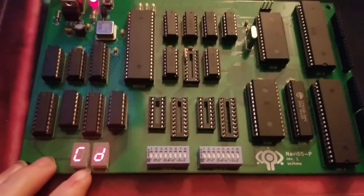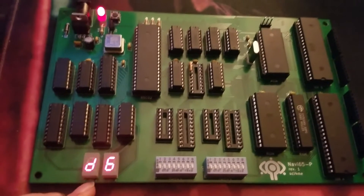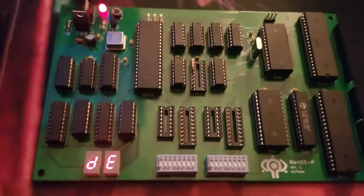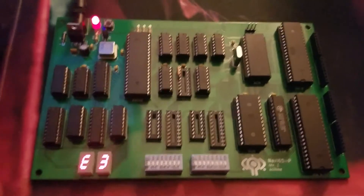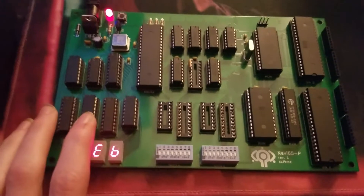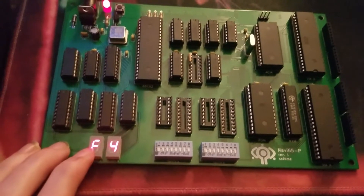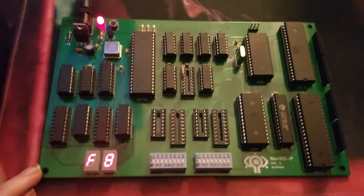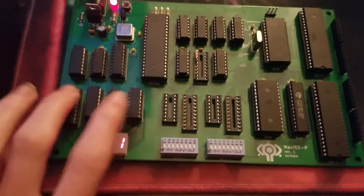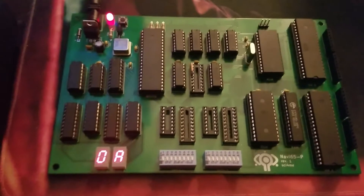We have seven segment LED displays. Funny enough, when I picked these I didn't really look at the price or pay attention to the size, but I stuck with them. They look good enough, but I definitely need to get some cheaper ones for the next version. These two resistor arrays are for current limiting — they're 470 ohms, and it turns out that was not nearly high enough. So these are not actually just turned on and off; I'm doing pseudo-PWM in software using a timer from one of the VIAs. These two chips here are basically 8-bit registers, flip-flops, that are addressable by the CPU so we can write to those.